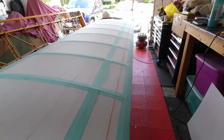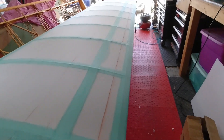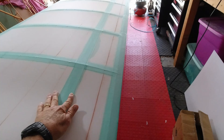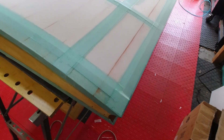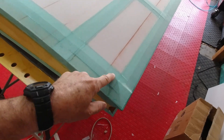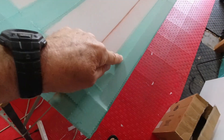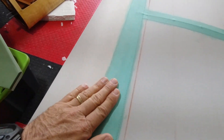As the fabric bounces up and down, we won't get any wear in that location. I don't really know why I haven't seen anyone do this, because it makes sense to me. These tapes are reinforcing anywhere that the fabric is laying on an edge by itself — along here, along this trailing edge, and up on the leading edge where you've got this kind of edge right here, covering all of those areas.